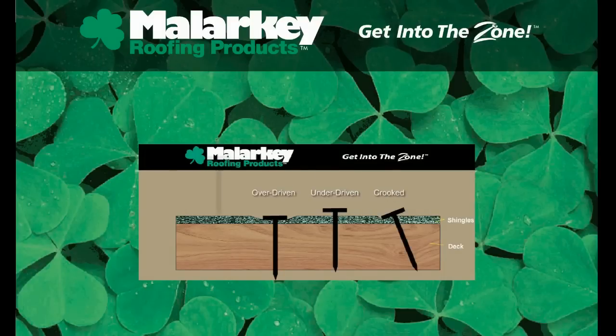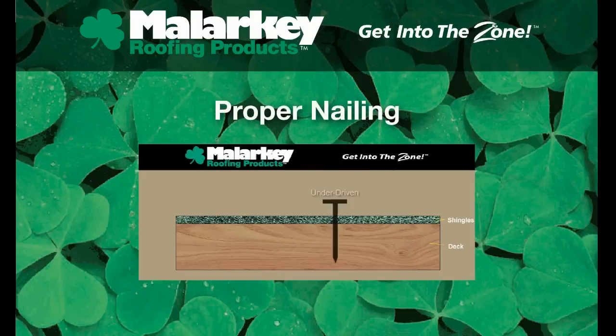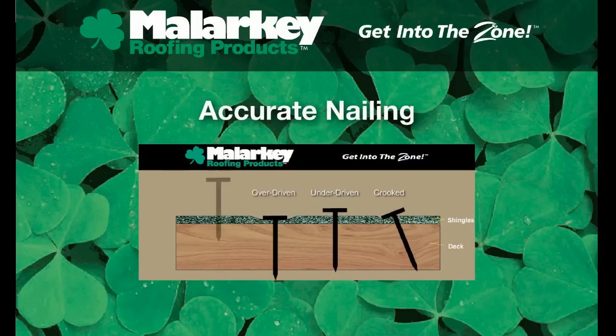The ease with which shingles featuring the zone are applied lets you focus on the most important part of installation: proper nailing. Proper nailing is critical to the long-term performance of your roof. The zone helps you place the nail accurately through both layers of the shingle, perpendicular to the roof deck and nailed flush.